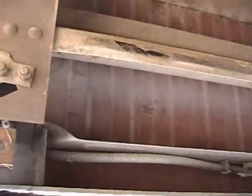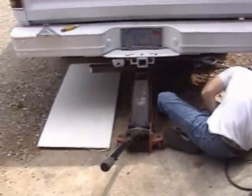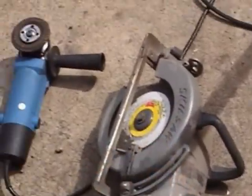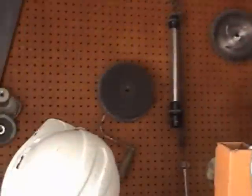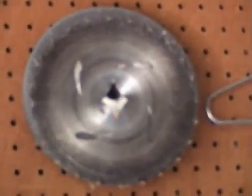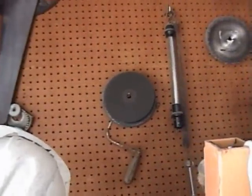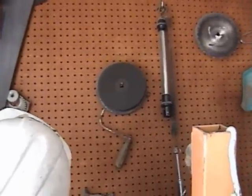We're gonna do some triangulation. Joe is about to start welding — he's doing his first brace support right up underneath there, with a jack supporting it. Tools we're using today: not just a regular wood blade on the skill saw — we've got the grinder out and we're also using a cut disc for metal on the skill saw. These kick up a lot of sparks and cut a little slower, so take your time. But it's really efficient — ten times faster than a grinder, way cleaner.